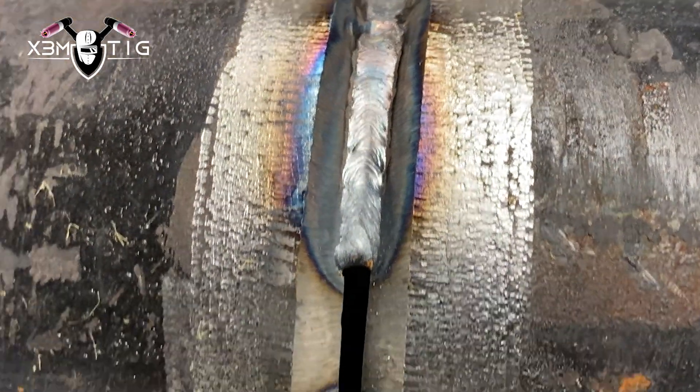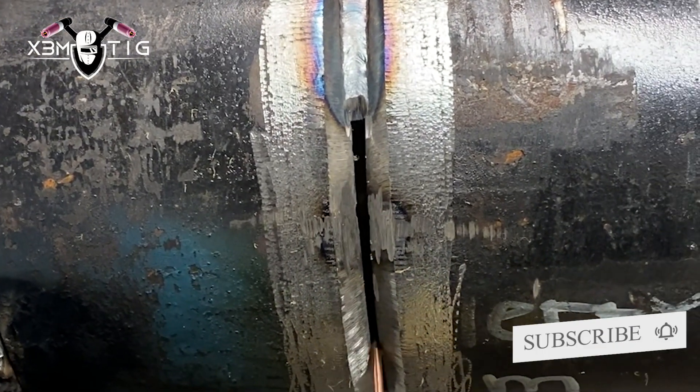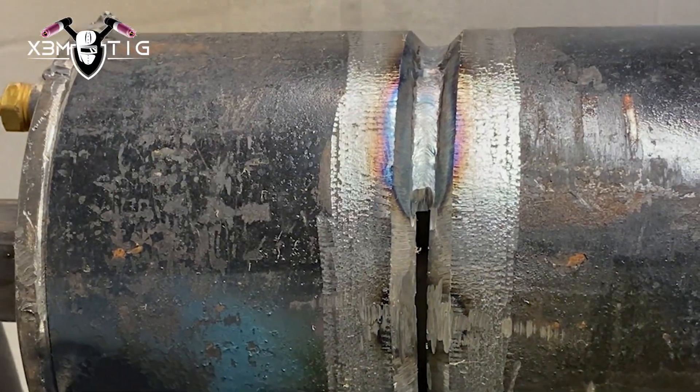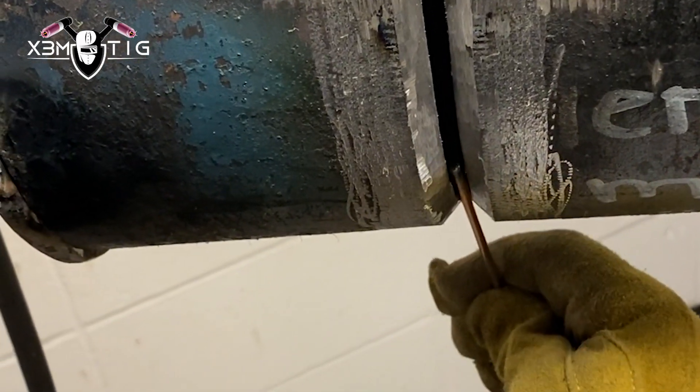On this side we're at 10 o'clock. The pipe shrunk — I cut that bridge tack and now I can't fit my 1/8 rod inside, so I'm going to grab a grinder, open that up, and clean all those fibers on the side. Now we've got enough room. I'm going to keep continuing. Now we're going into that critical part, going down to 2 o'clock — from 2 to 4 o'clock — that's the most tricky part. On this side I always get confused: this is 10 o'clock down to 7 o'clock.